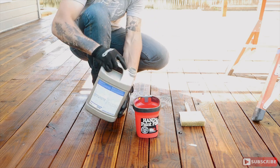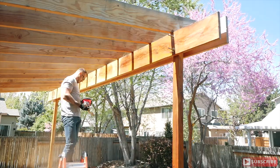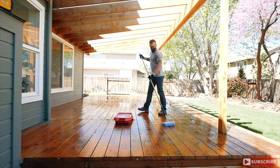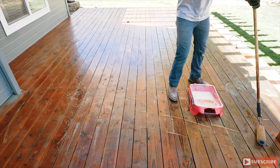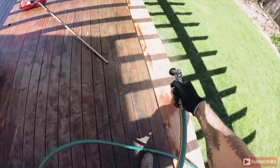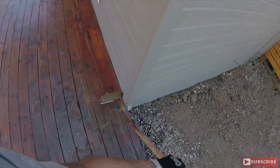Now typically when it comes to restaining your deck, it involves adding one fresh coat of stain every two or three years. If that's your situation, you don't need a stain stripper — you need a deck stain cleaner, which degreases the area and gets it primed for the fresh coat. In our situation, we want to start from the ground up, so we need to strip this color. The chemical works best with 15 to 45 minutes of dwell time. The hardest part is not letting it dry — walk around with a mist setting on your garden hose, lightly fanning the area to keep it moist and activated. Once you see a filament rise to the top and it starts frothing, you're ready to pressure wash it off.